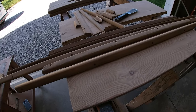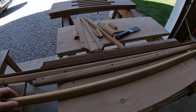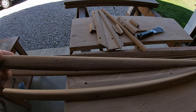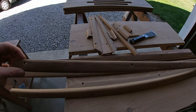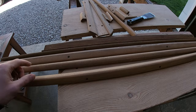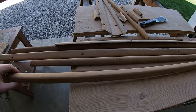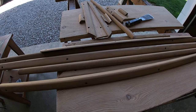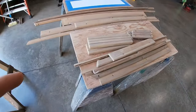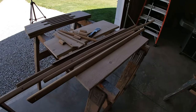All right, guys, we got most of this sanded, second round. So pretty much since the previous owner painted the teak gray, it's kind of hard, but you really got to take some product off if you want to get all that out. And the reality is you're not going to get every single gray piece out of there because some of the grain is really deep, so it's just not going to happen. But that's what happens when you paint teak. It's a lot of work and a lot of sanding, and you will have to take a lot of material off. But guys, we're just finishing up. Got a little bit left to do over here, and then we will start staining everything here at the shop.